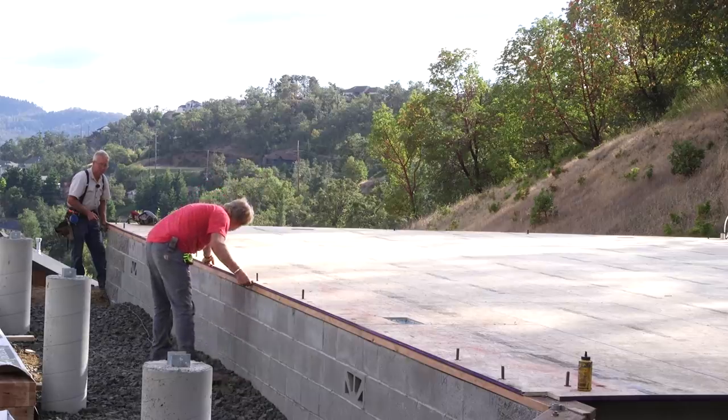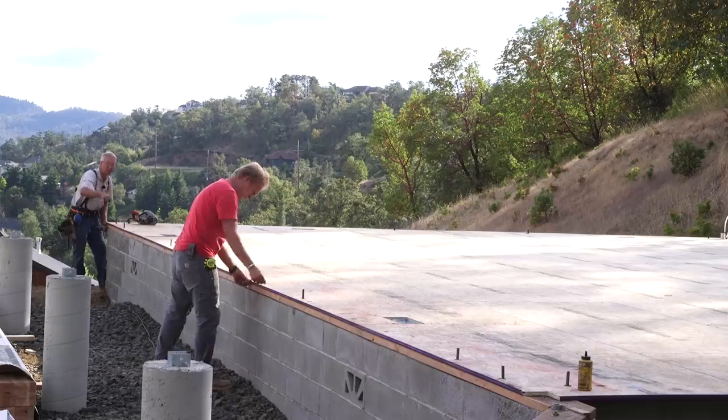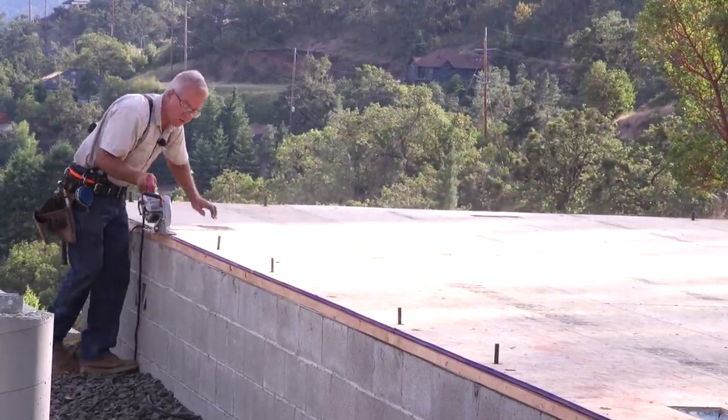Now snap it that way and then I'll snap. What I've settled on is that the front line of the house needs to be the presentation side. And with that in place, and the parallel line on the back of the house established, I cut off those two lines at the width of the house, which, by the way, is about 5/8 of an inch less than called out.